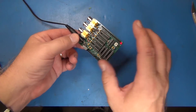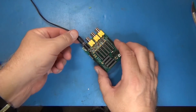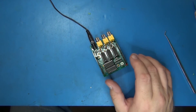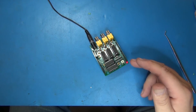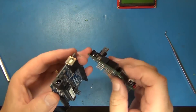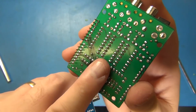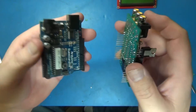The build is done, everything's put together. I didn't put the chips in yet because I wanted to make sure there were no shorts - I turned up the power slowly to check the regulator. I put a couple layers of electrical tape over the RCA jacks on the bottom to prevent shorts. I trimmed the RCA jack leads really short before soldering, which gives more room. There's electrical tape over the in-circuit serial programmer on the Arduino. Look for anything metal-to-metal that might short before putting a shield on.